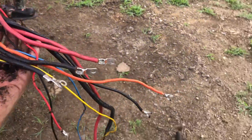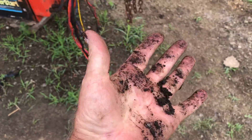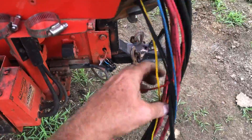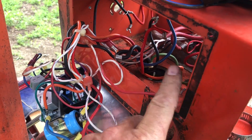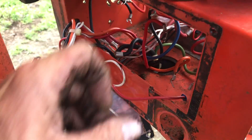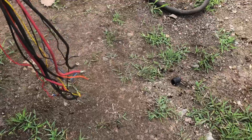That's what was inside that conduit — I just pulled that length off of there. As you can see, it's filled up with sawdust and water. It's not likely to damage that wiring, but my concern is the integrity of this control box. There's already some dusting, gunk, and stink bugs in there, so I'll clean that out and get that new conduit on there.